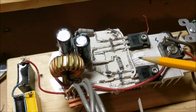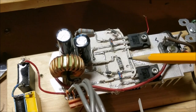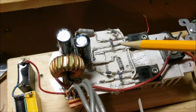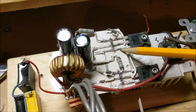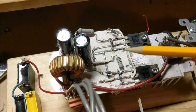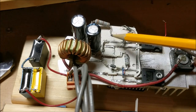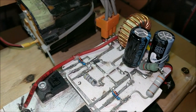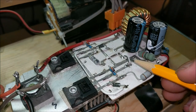If we take a closer look at this control board that my ZVS flyback driver is running on, you can see that I actually made this in my house. This circuit board is homemade — I drew out all these traces on it and then used ferric chloride etching solution to remove all the copper around the traces I drew. All these components are soldered in place, and all the copper traces have an extra layer of solder on top, because the currents are so high that if I left just the thin layer of copper it would literally explode — and I have had that issue. One of the resistors on the other side of this capacitor actually exploded due to high currents and not enough solder, leaving a little blast mark underneath.